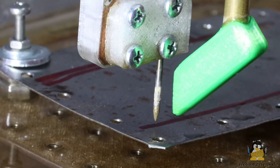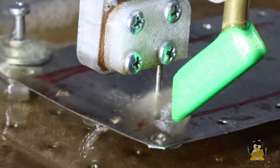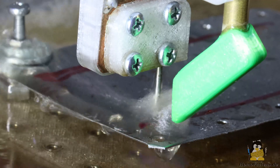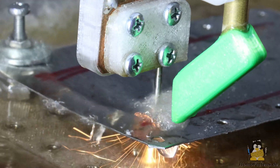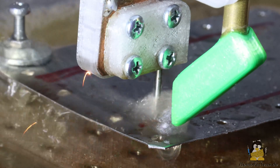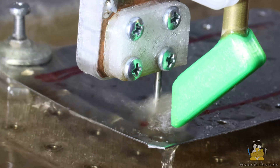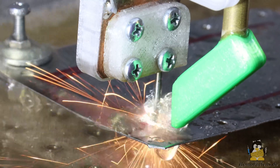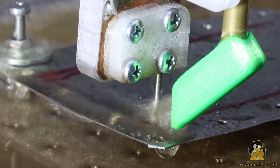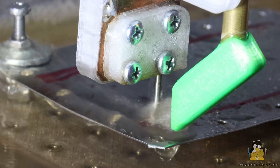The aim is to develop a machine capable of processing steel with a precision that won't be perfect but good enough for my purposes, while being easy to replicate — nothing more but also nothing less. Drilling a 1.9mm hole in 2mm thick steel is a good start. The drilling goes through 0.5mm thin steel faster, at just 40 seconds.